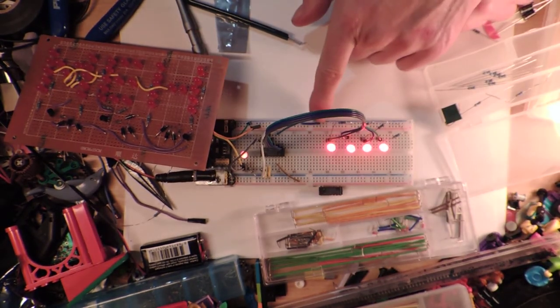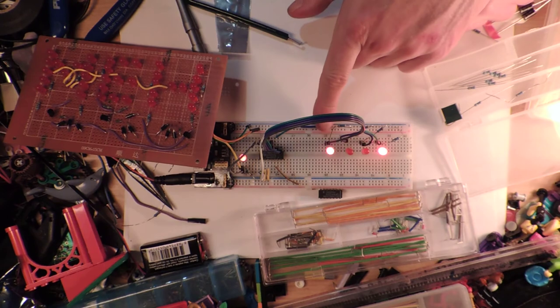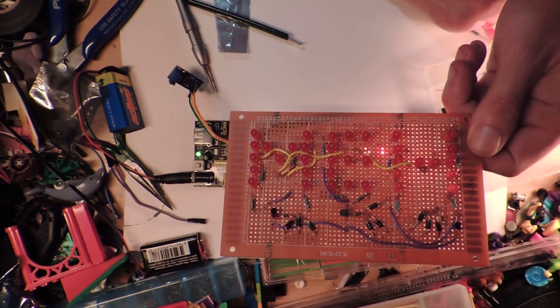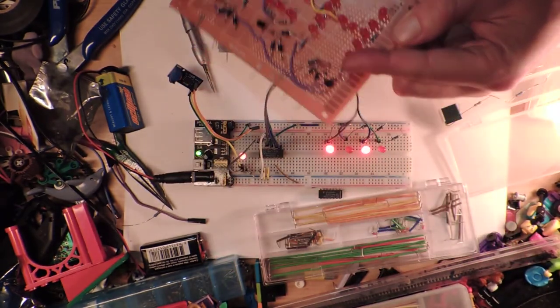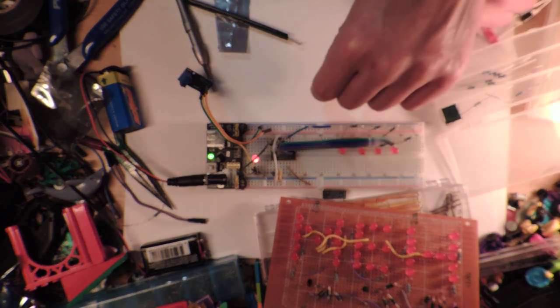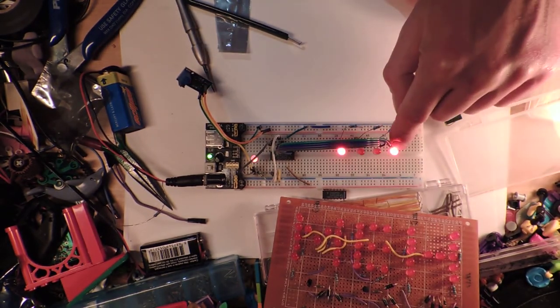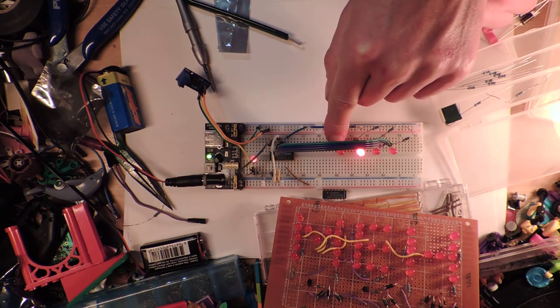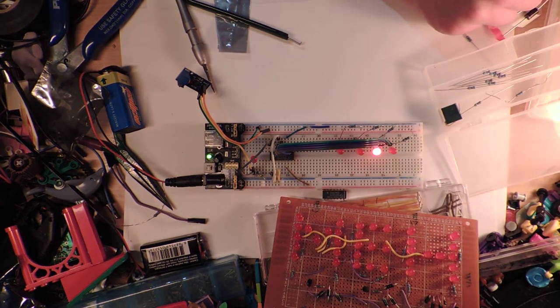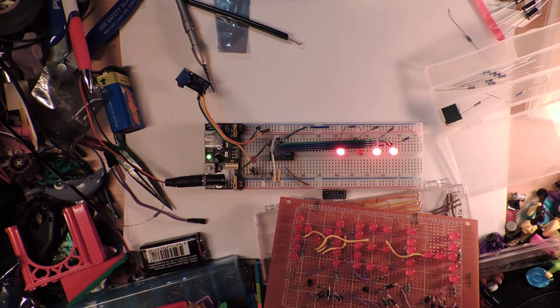But the problem is, this is going to be a clock that's coming off here at 5 volts, and it's going to be going into a 4017 running at 9 volts. But then again, there's actually no reason at all why the 4017 has to run at 9 volts, because I only need 5 volts at the output to run the transistors. So that will work out fine, actually. And that way I can have a slow mode where I'm clocking it off the end one, or I can have a fast mode where I'm clocking it off this one, with just a switch, none of these little nasty analog thingy-watsits. So anyway, that was what I thought I'd do.